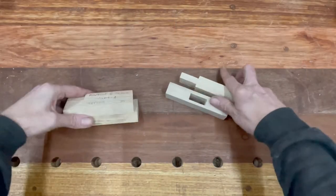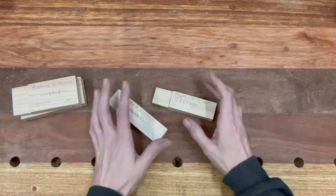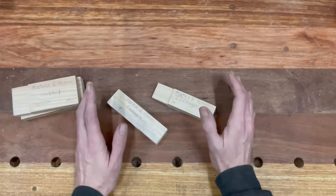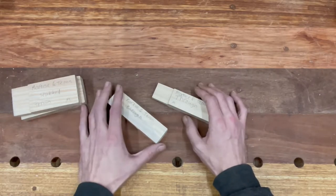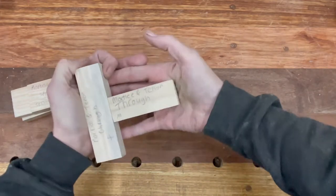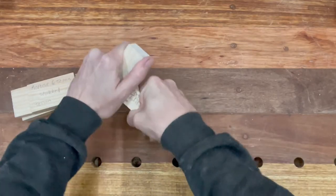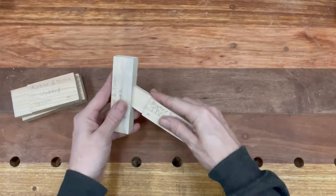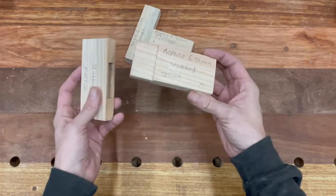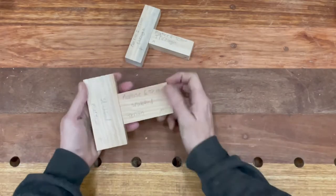What we've got here is the mortise and tenon joint. You're going to find a mortise and tenon in timber frame buildings, but it's also an essential joint for making tables and chairs. This one here is the through mortise and tenon joint — the description is in the name, it goes right through. And then this one is a stubbed or stopped one, which essentially stops halfway through. All these variations have different applications depending on what you're doing.